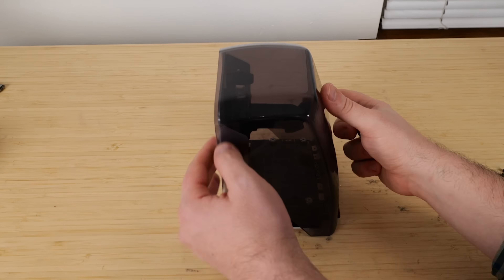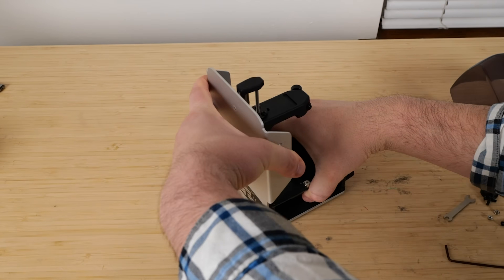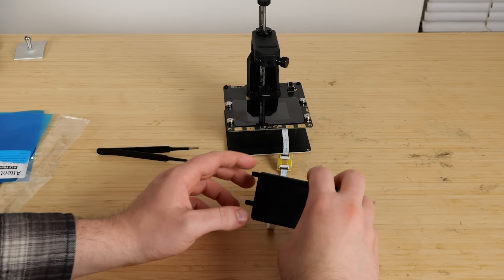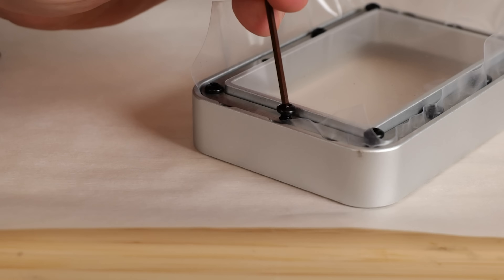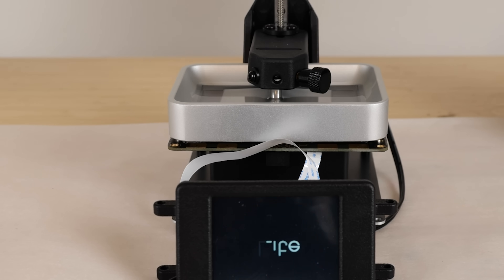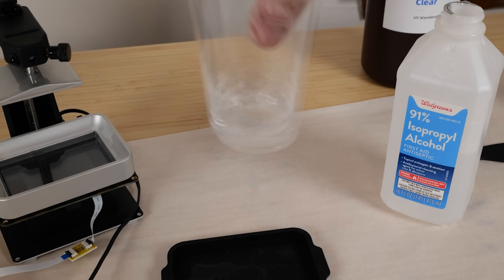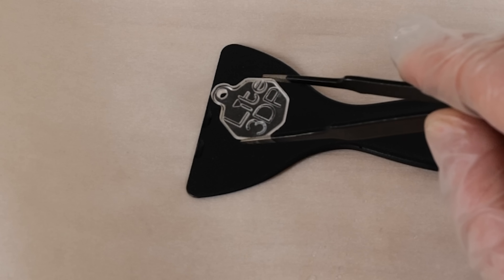And while it is really small, in order to make this still a manageable size, I'm going to have to shrink this down a bit. I also bought a ribbon cable extender because I wanted to relocate the touchscreen. And after finally setting everything up, it's time for a test print. And after a quick wash in isopropyl alcohol and blasting this thing with some UV light, this test is officially a success.